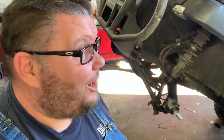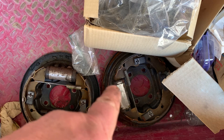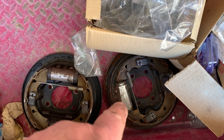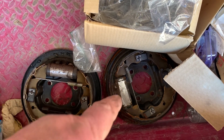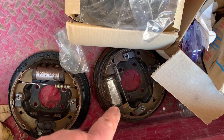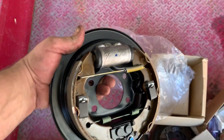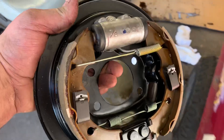What's up guys, More Medic One here. Today I want to go over this little Kawasaki Mule — this will kind of be a part two of the catastrophic bearing failure. I showed you yesterday that the customer lost all of his brakes because the drum was rubbing the wheel cylinder and basically rubbed it down far enough to where it got into the seal and all the fluid leaked out. I've got my new brake cluster right here and we're going to install that.